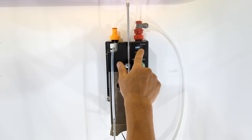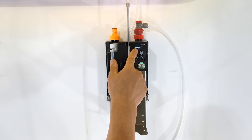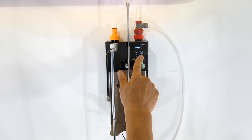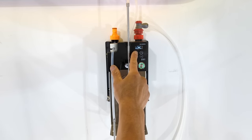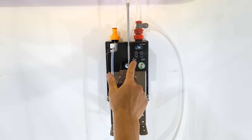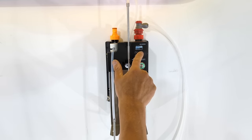And at the moment it's got a 2 second purge and fill up to 110 millimeters in height. So I'm going to go into that purge setting here, and I'm basically going to change that to something really high. I'm going to say like 30 seconds. It's probably way too much for any normal filling process. But for the sake of this, there you go. I'm at 30 seconds, which is really a lot, but it's going to make it easy to do this adjustment.